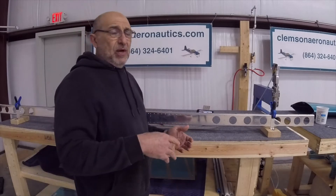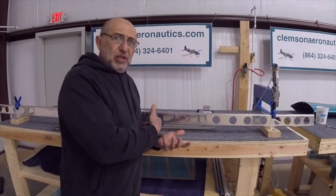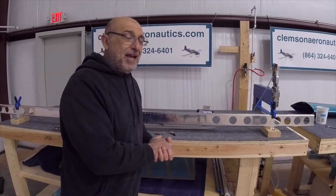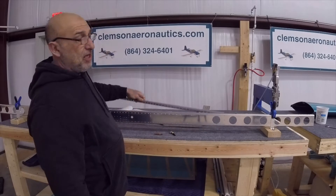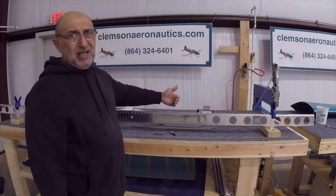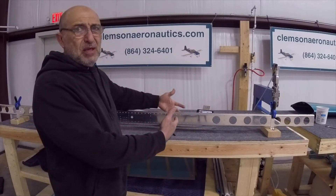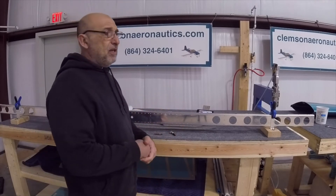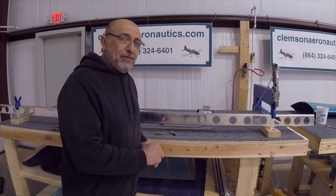I'm going to run the videos I took at higher speed so you don't have to go through the agony of watching it in real time. I just wanted to explain the match drilling process for the caps — it's kind of important. There's a lot that will be tied to it later; the ribs are riveted to that and so forth, so it's important for it to be nice, clean, and positioned correctly.